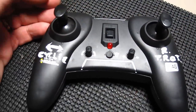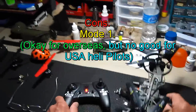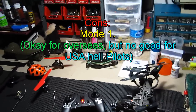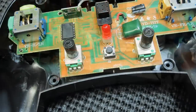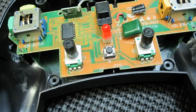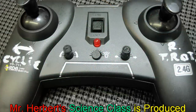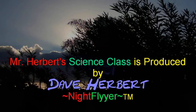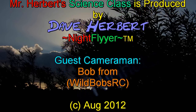Pretty cool, but if you're a helicopter pilot, having the controls backwards, you're going to have a hard time learning to fly this. I panic and go the wrong way. This thing needs to be in mode two. Well, I opened the transmitter to see if I could switch the controls. It's going to take some thinking — I have to cut some circuit lands, then make jumpers and recalibrate the transmitter. Right now I'm just going to leave it as is and save it for a winter project. I'll learn to fly it as it is.